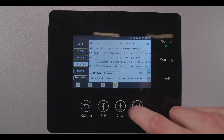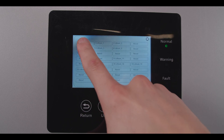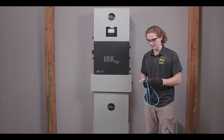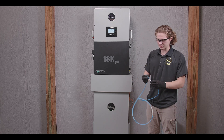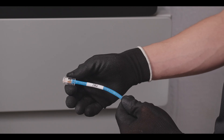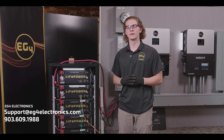Set lithium brand to zero. If you have four batteries, you're going to need a specific cable with a specific pinout. That pinout is going to be 1 and 2 to your batteries and 7 and 8 swapped to your inverter. If you have any other questions, please reach out to EG4 Tech Support. Thank you for watching.